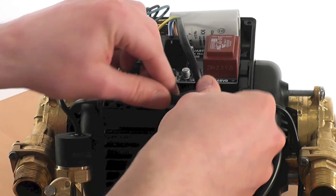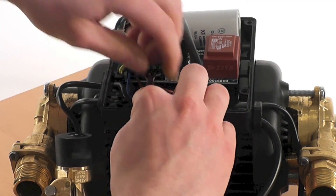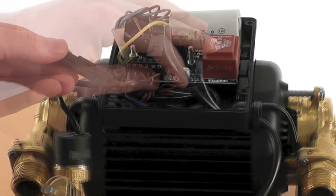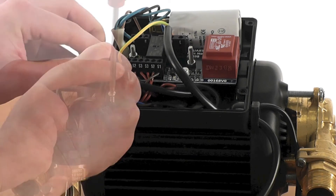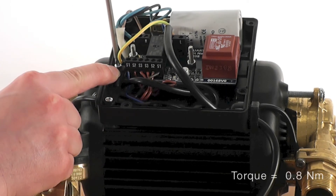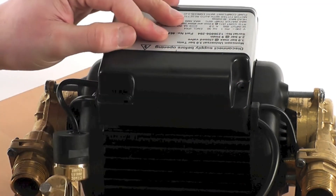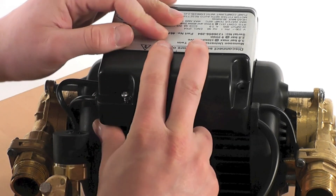After connection, ensure all wires are safely tucked out of the way of the terminal box lid and are routed so they miss all components on the PCB. Next replace the cable clamp in exactly the same orientation as noted earlier, and tighten the screws to a torque of 0.8 newton metres. Now replace the terminal box lid, again securing the screws to a torque of 0.8 newton metres.